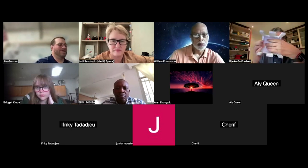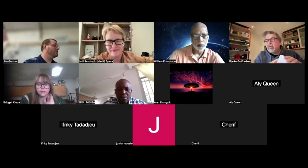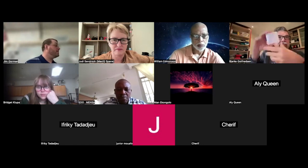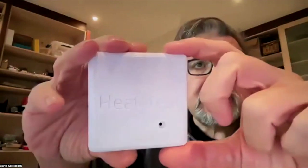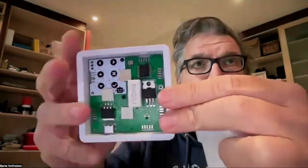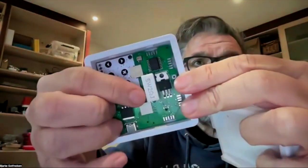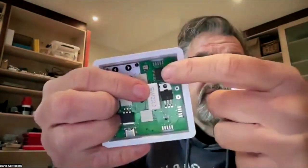The battery is in here, and these screw holes are there because a plate comes up underneath that then insulates the battery from the outside. The battery module also has a heater. I have this little heater experiment I've been playing with as my heater test. This is a little box that has a similar size wall. And this is actually the heater. It's one big resistor, and then there's a MOSFET that turns it on and off, and a control board.